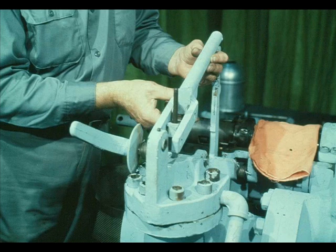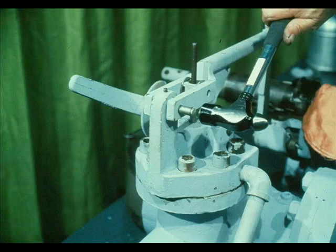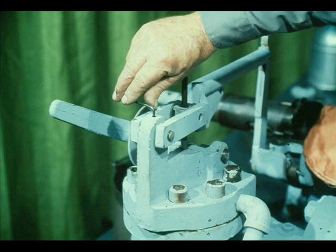Lower the resetting lever over the valve stem. With the resetting lever in position, slip the guide blocks onto the slots in the connection block. Once you've tried this for yourself, you'll find that it's not nearly as complicated as it sounds. Now align the hole in the stationary end of the resetting lever with the hole in the anchor bracket. When they are aligned, tap the anchor pin into the hole. Remember to lock the anchor pin in place with the set screw.